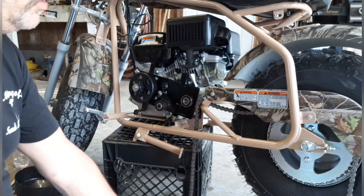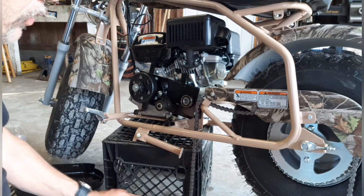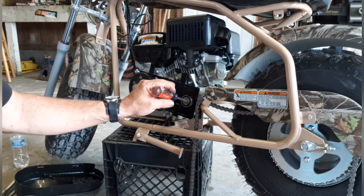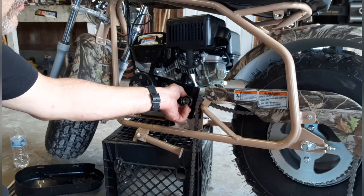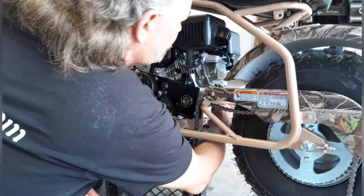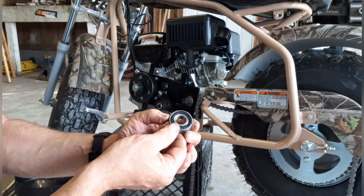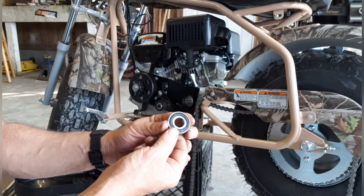What that left me was the shaft and the two bearings. What I had to do was take a proper punch and a hammer — I actually used a screwdriver. I went down and caught the very edge of the bearing and I tapped it with a hammer until the bearing popped out. Then went to the other side and pushed this bearing out the same way. After tapping the bearing out — there is what your bearing looks like. The part number is 6203RS. It's just a tiny little ball bearing, probably used in all kinds of stuff like alternators and well pumps and other things.